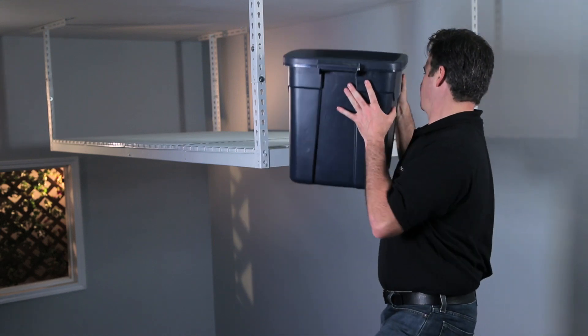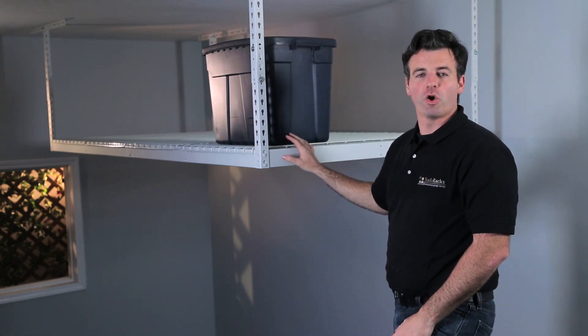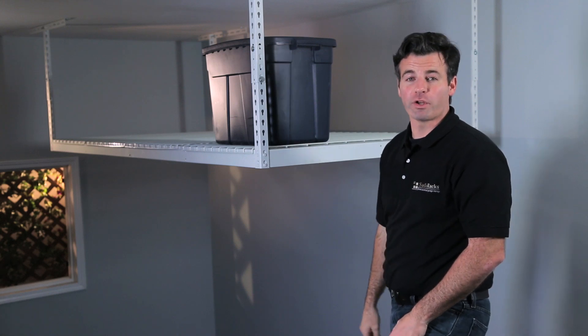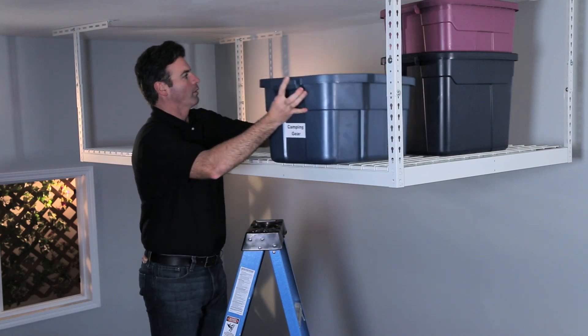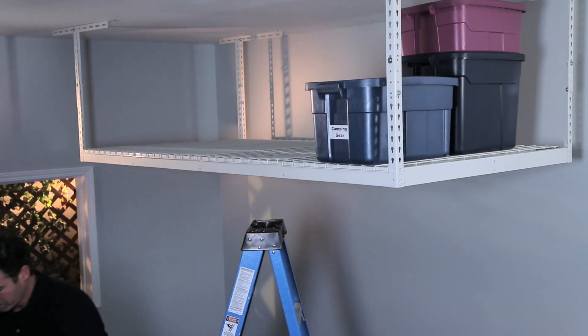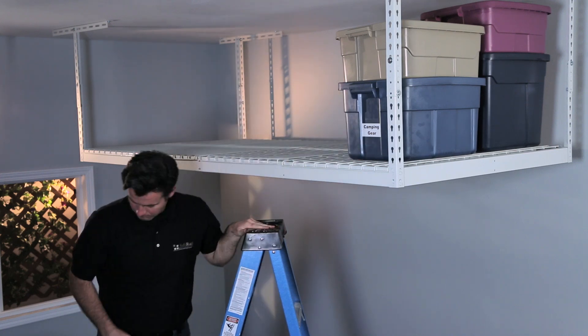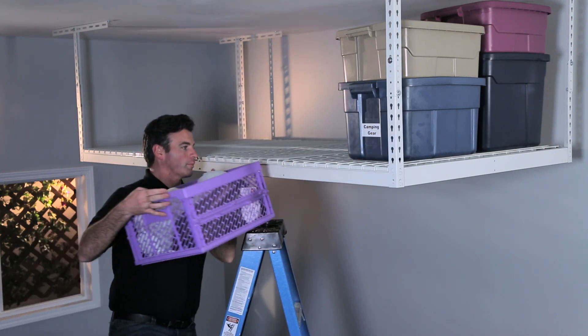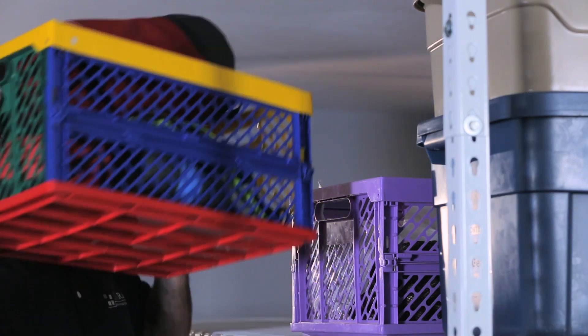You're now ready to organize your garage using SafeRack shelving. When loading your SafeRack, be sure to pay close attention to all notes, cautions, and warnings. Having a spotter when loading your items is also helpful. Place your heaviest items closest to the vertical posts and lighter objects in the center. Load items evenly and avoid stacking items that are not adequately supported. Be careful not to exceed the maximum capacity — this 4x8 rack has a 600-pound weight capacity. SafeRacks are designed to last a lifetime when properly installed, which is why we strongly recommend watching this video in full and reading through the printed instructions. If you have any questions, call us at 877-655-3443.